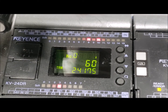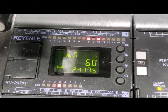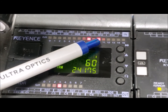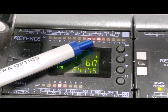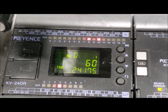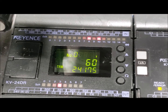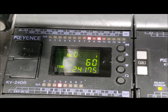To start off, what we're looking at on the PLC right now are inputs 8 and 10 that are lit up. Input 8 is the input sensor for spindle up, and input 10 is the input sensor for swing arm left. So right now our Mini 2 is in the above-the-washbowl position — upwards and to the left. This is your standard position in an idle situation.